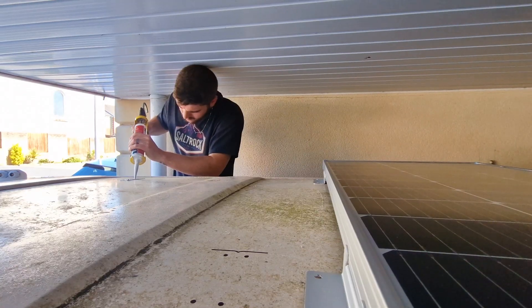So the first job is to tackle the solar. The panels are already up on the roof and ready to be drilled in. First of all we've got to connect the solar cables up in a series connection. I'm going for a series connection because it's just better in the Welsh weather — on cloudy days you still get a little bit of solar power rather than going for a parallel connection. So we've got to connect those up, apply some sealant to the brackets, and screw them into the roof as well so they're a really strong fixing.